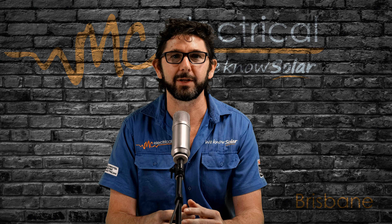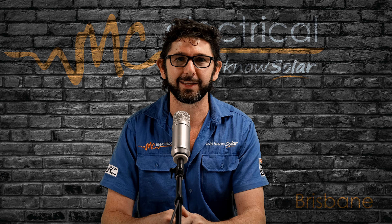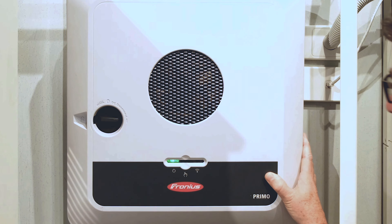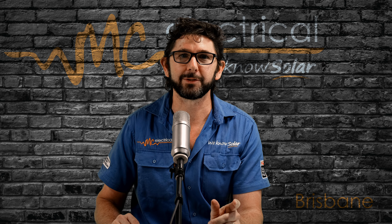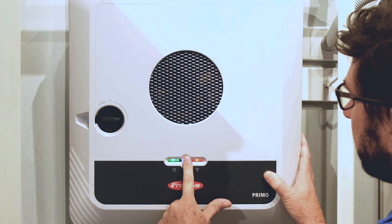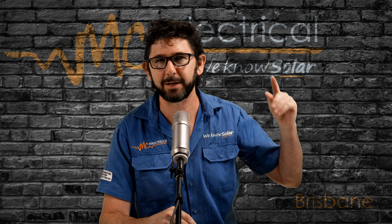Before I explain the button on the Gen24 — this part between the two lights is an optical sensor, or optical button. When you tap this optical button twice, it will flash green. Tap it just two times relatively slowly, and this means it is trying to connect to your home Wi-Fi via WPS — you'll want to watch this video for instructions on how to do that. If you tap the button just once, it will flash blue, meaning it is ready to connect to your phone so that your phone can be used as your inverter screen. That's pretty handy, and you can do all sorts of things when your phone is connected to your inverter.